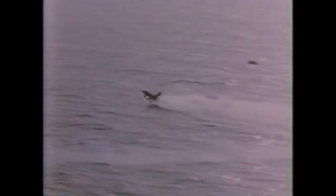The second open sea operation was conducted in sea state 5. Primary swells of 6 feet were running at 70 to 100-foot intervals. Secondary swells of 2 feet were imposed upon the major pattern, and every seventh swell was between 8 and 10 feet in height. One 12-foot swell was observed immediately before landing. The landing was made parallel to the major swell in approximately 90 degrees to the surface winds. This entire operation was filmed at 64 pictures per second, which slows down the action of the sea and gives an impression of calmness where such a condition does not exist.